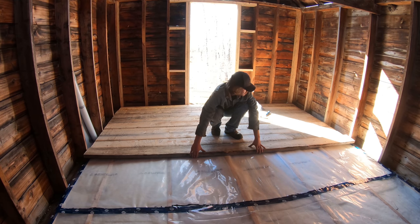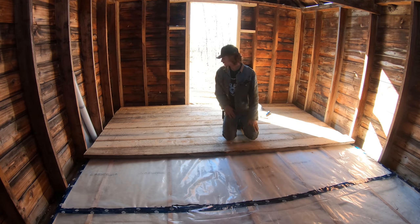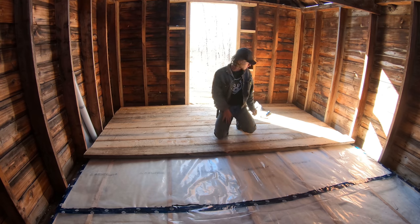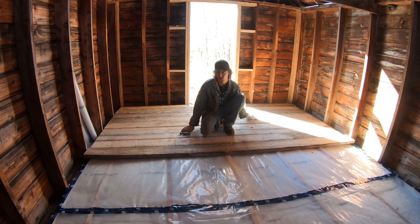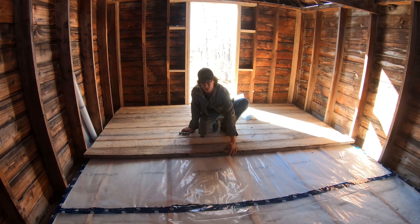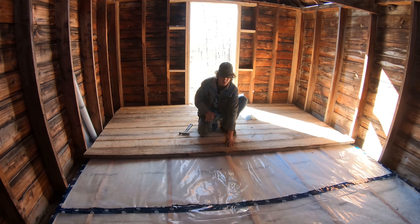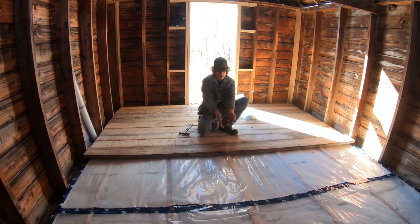Just a tad too long is no worries, or too short — just maybe an eighth of an inch. Now, we've got to be careful — this has to be straight. I do not want a crack there. I have one very small manageable crack, just a couple, but so far I'm doing real good. They're all nice, and I'm butting them right up as close as I can, because it's very possible they shrink. Now, whether we're nailing a board, a piece of plywood, or putting the head back on the 12 valve, you always want to start from the center. These have been sitting in a pile and there's a bit of a bend to them. If we start in the center, we can relieve the stress out of it. These are four-inch spikes here, and I'm just going two per — make sure we keep her butted right up.